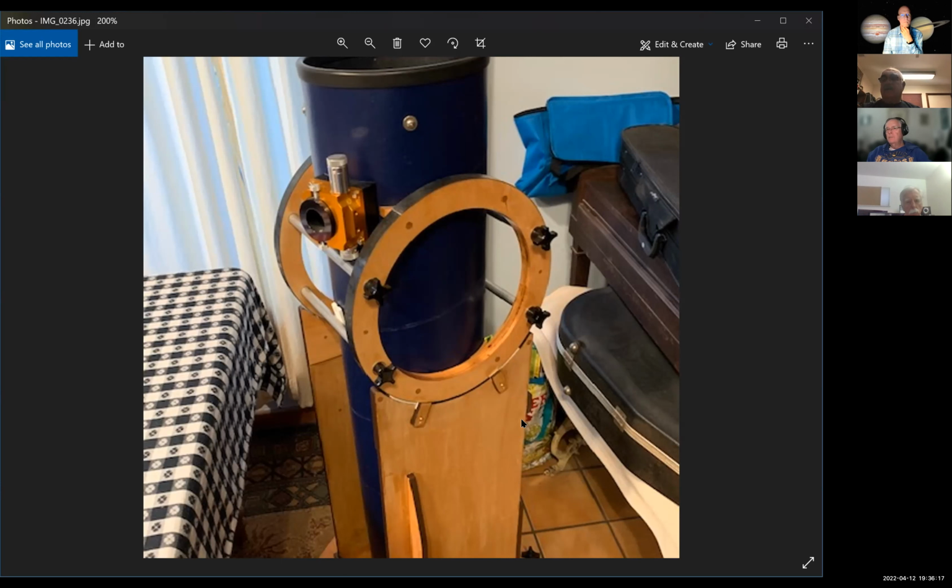It might. A carpenter buddy of mine told me a trick one time, and we were working in our dental lab, and Mike, there was a vertical wall. It was just a pony wall that was made between two benches, and you could reach your hand out and literally shake that wall, and it would move maybe 6 inches one way and then the other. It was just terrible. So he said, now watch this, Tim. And he went and got a sheet of plywood that was a quarter inch thick at the most. It might have even been less. And he nailed that to the sides, either side of that wall. And he said, now shake it. And you could move it, but barely, just barely.